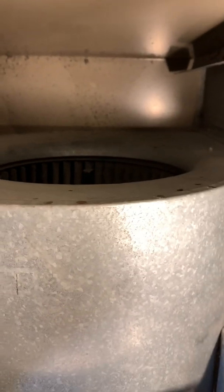When we changed the motor we realized — check it out, see that wheel? It's all bent. That could have fried the bearings in the motor to start with. So we're going to take the new motor out, take the blower wheel out, and put the new blower wheel in.